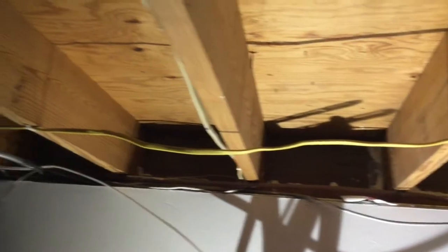The power for those two lights was originally coming off the back of a fixture on the opposite side of the basement. Since we're putting these on separate zones, we need to disconnect from there and run this wire to the junction in the ceiling on the other side. We'll disconnect from that fixture, take this wire down, and connect it to the electrical box. The yellow wire there was the original power source wire — we're rerouting it because you don't want it laying across the top of joists since that prevents safely drywalling the ceiling.